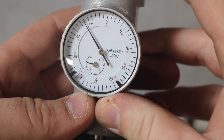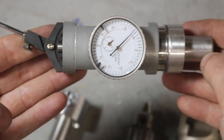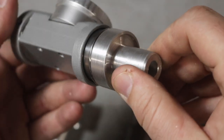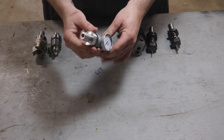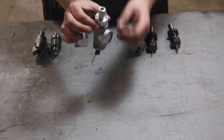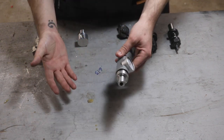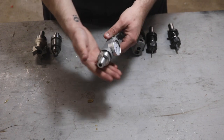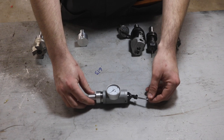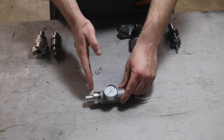This piece is made out of aluminum and it holds a coaxial indicator. It's pretty handy for finding the center of holes, or even more specifically the outside of round features, to get your mill spindle on center or at least find a relative position. This isn't a very expensive one — I believe I got it for under a hundred dollars imported. The shank I made to fit inside the TTS collet matches an angle that is on the shank of this, and then it has a small post. It was designed to be held in a collet of its own. This is made out of aluminum because it doesn't need to have any sort of strength or massive amounts of rigidity. Part of the reason I made this instead of buying a 3/8 shank tool holder or putting it in an ER collet is that I wanted to minimize the Z height of this tool.